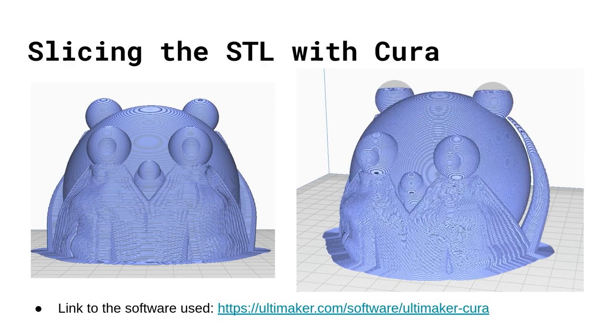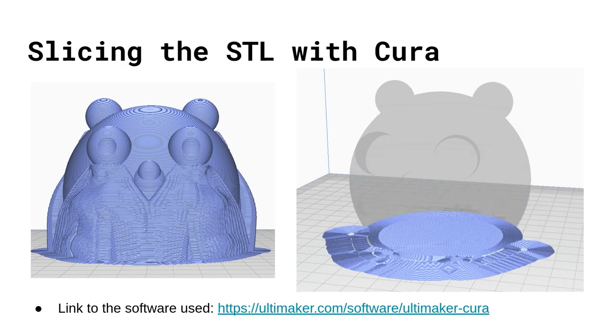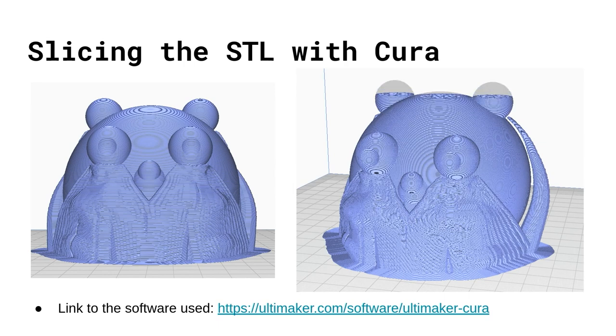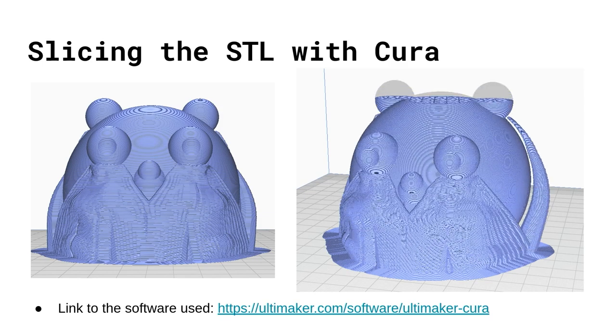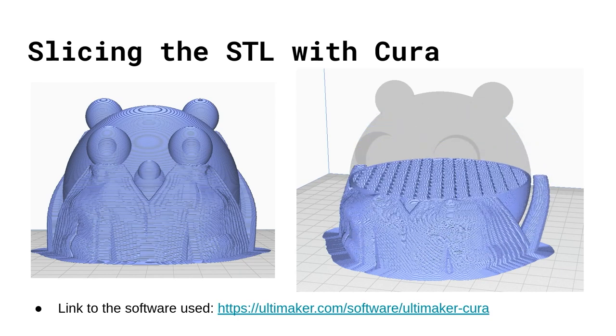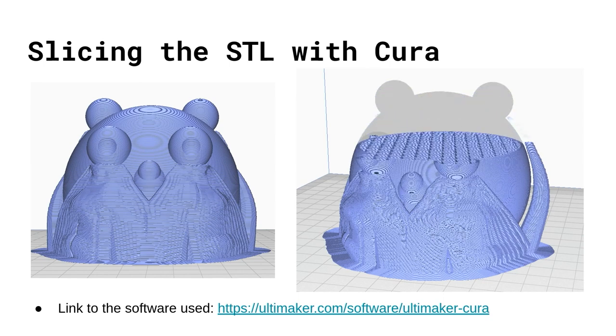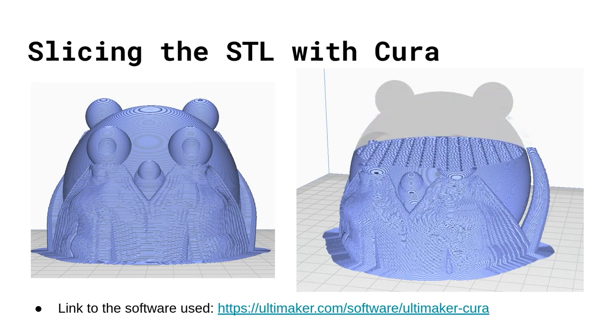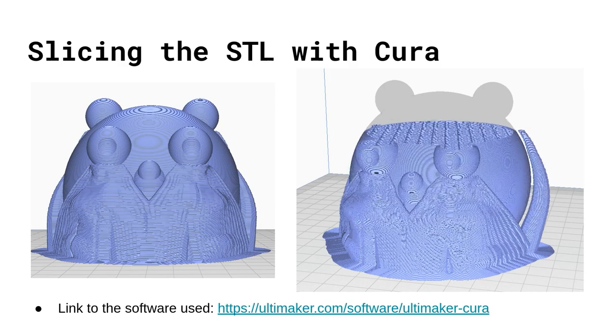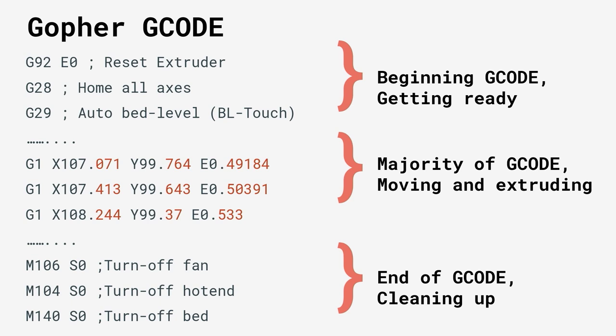The slicer provides a preview screen of how the sliced gopher looks. You can notice almost-tears coming out of its eyes — this is the support structure to keep its eyeballs in place while 3D printing. We also have a GIF showing all the layers that it slices, where each layer is described in G-code of how to print that layer. Here is our gopher's 3D model described as G-code, with the majority of the code describing the movement of the nozzle and build plate, plus miscellaneous functions to heat up — everything we saw before. With this G-code, we are now ready to 3D print a gopher.